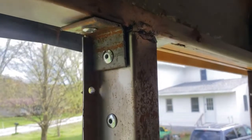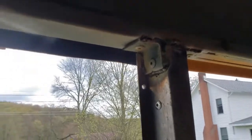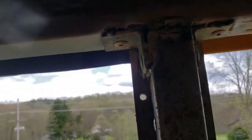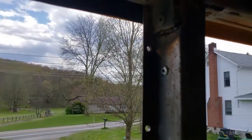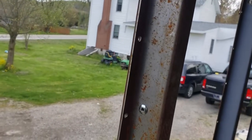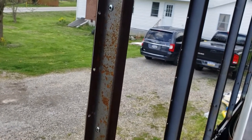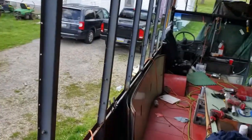That one's riveted in place and I'll go to the other side. I finished welding those two angle pieces up in the corner. These angle pieces are now riveted and welded — this isn't going anywhere. I'm going to stiffen things up in the middle by welding the inside and outside hat channel pieces together. Then I'll finish grinding from the outside and put up the sheet metal.